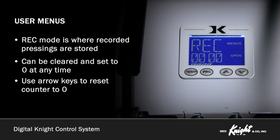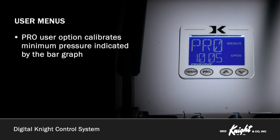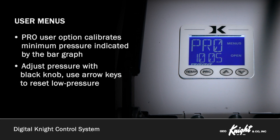Press Program to continue. The PRO user option is where you can calibrate minimum pressure indicated by the bar graph. Adjust the pressure of the machine using the black knob to be very light when clamping and locking the press. Press either arrow key to reset low pressure while the press is clamped. This feature is only available on certain models. Press Program to continue to the pressure maximum setting.